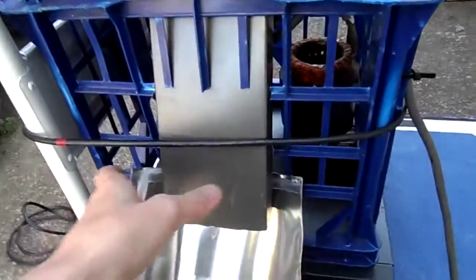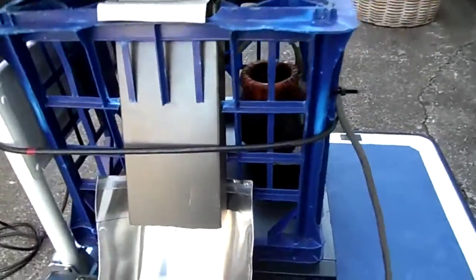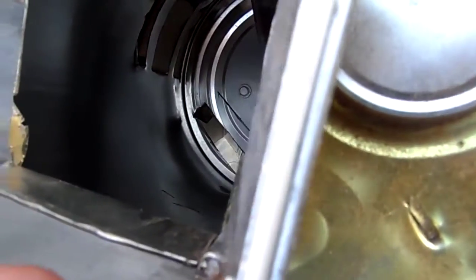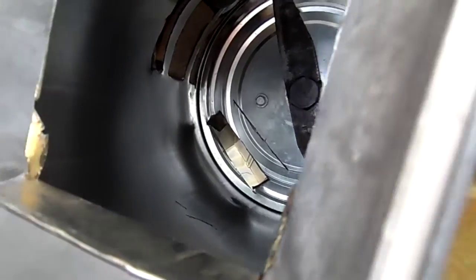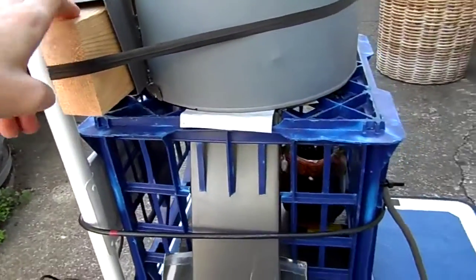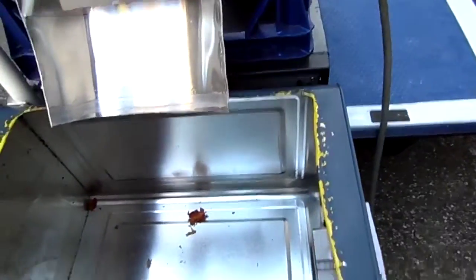Recently I've actually done a bit of work on it. I've added a second discharge chute so I can get two different particle sizes. This one's got just one large slot down the bottom there — it's about 3 inches long by about 15mm wide — and that allows smaller particles through a lot easier. I've got a tub and everything to collect the output in.